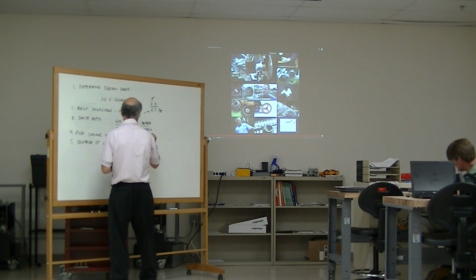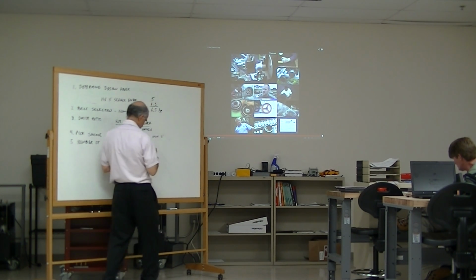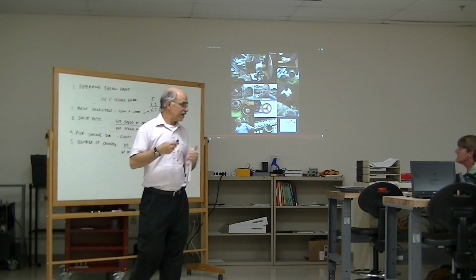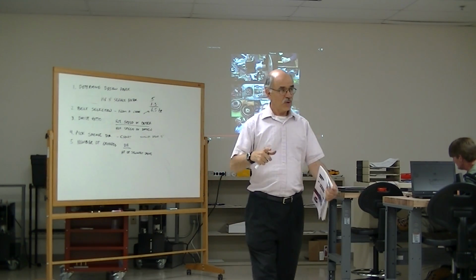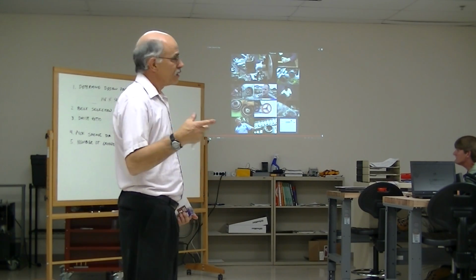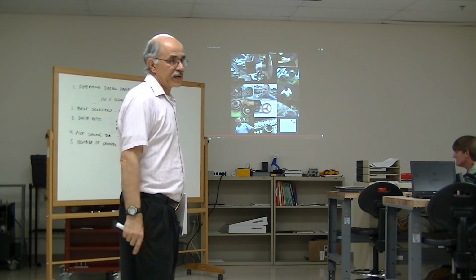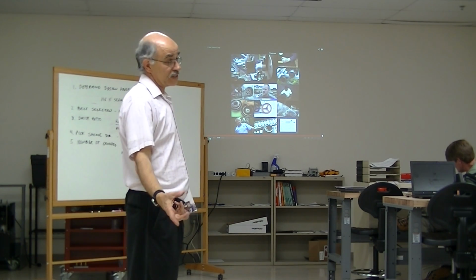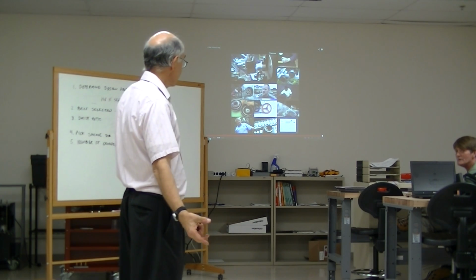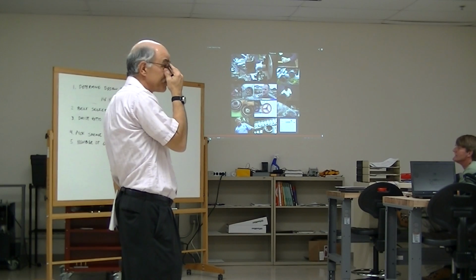So remember up here, I figured out I needed a smaller sheave of 5 inches. And so I go to my bin and I go to my 5-inch sheaves and I pull one out and I notice it has, let's say, a 3 horsepower rating. What's that tell me then? Need 2 sheaves. Actually, I'm going to need more than that. I'm going to get 6.5, so I'm probably going to need 3.